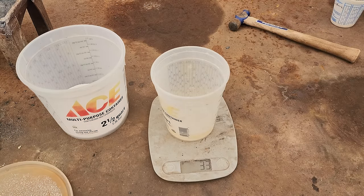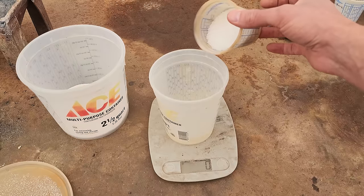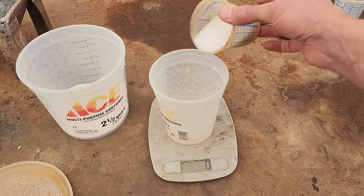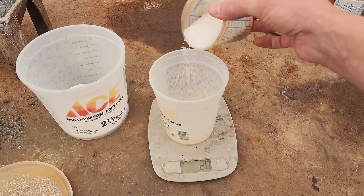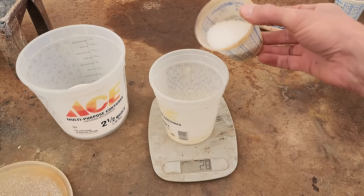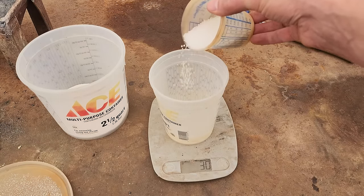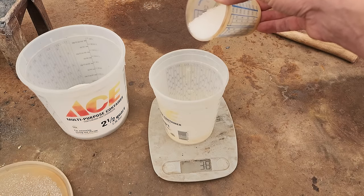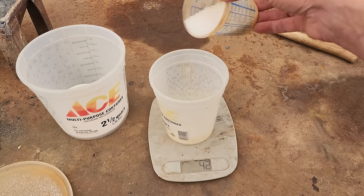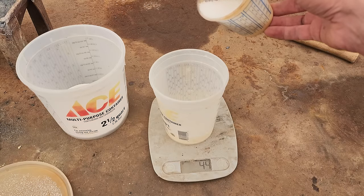30, somewhere in there. Now, because we have a sulfide-rich con, I'm gonna add in some potassium nitrate. And what this does in the smelt is it releases oxygen, which bonds to the sulfide molecules as well as the sulfur that's driven off during the smelting. And the idea is that it turns the sulfides into oxides, which are then absorbed into the slags.